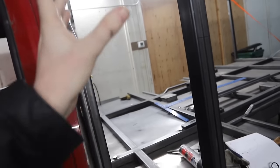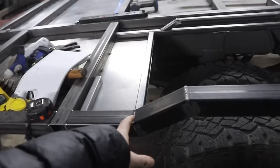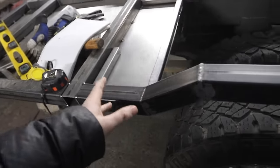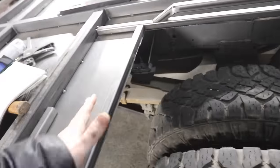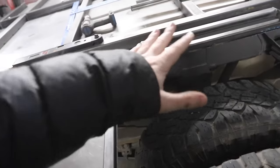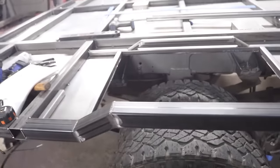There are a few bars that come in through here, change angles, connect up here, and then work their way back down. Oscar also got started on our wheel wells. These are super beefy because we have a door opening right here, so we needed to make this strong — running through the frame with a lot of rigidity because people are going to be walking and jumping in and out a lot. It's two-inch on this side, and one-inch on the interior where it won't be walked on as much. It's all boxed out and supported. After flooring, insulation, and all that, it'll actually just be a one-inch bump in the floor, but this gives our tires room to actuate.